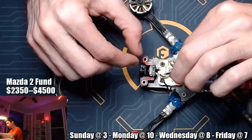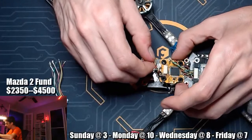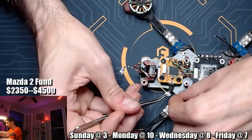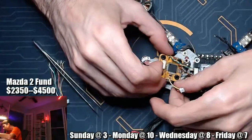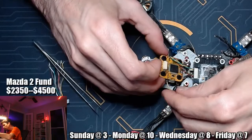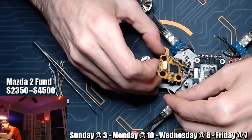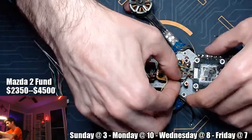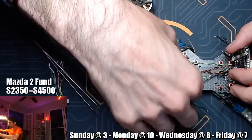Or the other option, the safer option, is to run this up over the flight controller. So I'll pull it out here, get these motor wires out of the way. Pull it up and out there. Make sure it's not creating a mess under here. That looks okay. I do need it to reach up to the front. I think I'm going to do it off on this side like that. Yeah, so let me give these guys a little spin, just to take some of the length out of them, like we've been doing with everything.